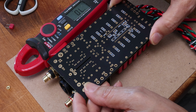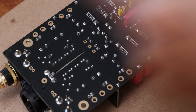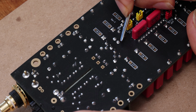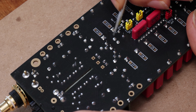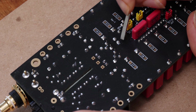So then you know why. Now, if you don't have any pointy instruments, the easiest thing to do is to grab a little flat screwdriver, just like that. And with the corner edge of the screwdriver, just pick the outer part here, because there's lots of room here versus the other side, where you've got another pad. So just on this side, you have tons of room. Just at the corner, scratch a little bit away. Just take your time.